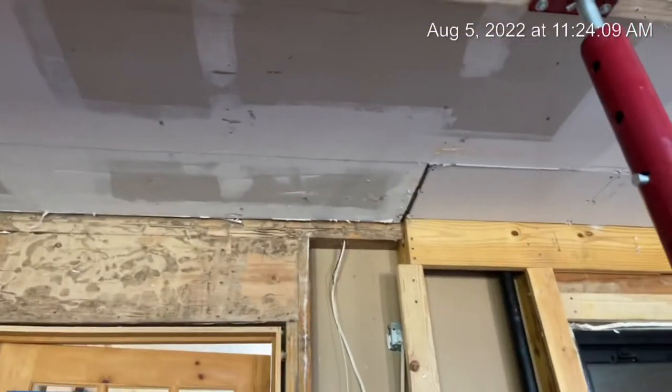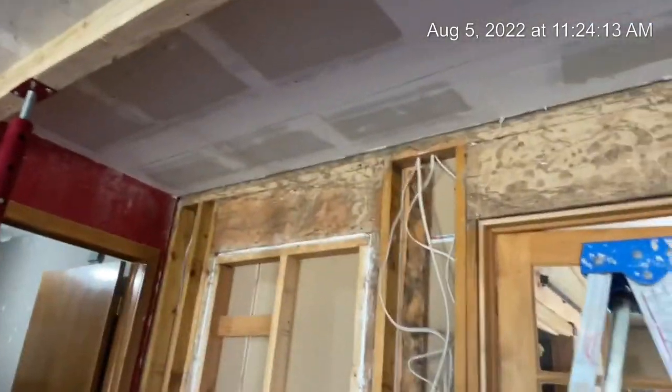I just ramboed it and did it diagonally — kind of took it at an angle and cut it. Now the fun part: I get to drop it and get covered in loose-fill insulation. This part really sucks. Just cutting the sheetrock is kind of messy, but this is stuff that's been up in there since the house was constructed. Remember, this is the original part of the house on this back wall, so this was an outside wall — load-bearing with the second story built on top of it, so it's got a heck of a load on it, which is why we're building these supports up. I'll let you watch me pull this down and see how messy it is.